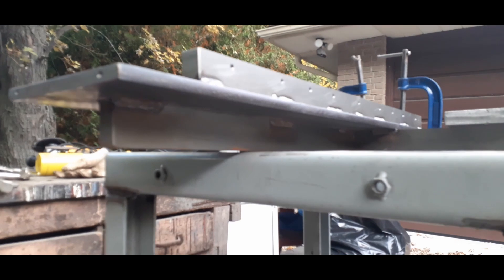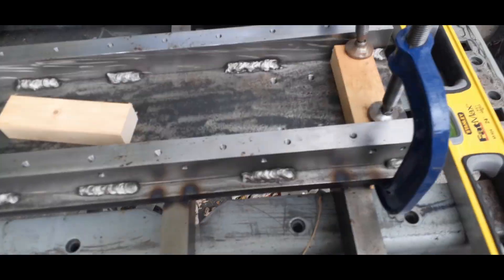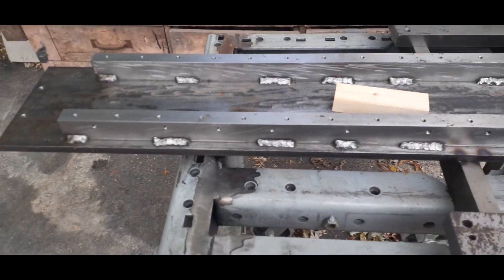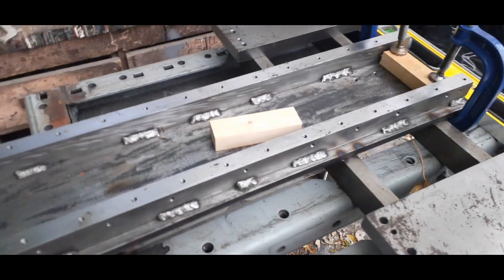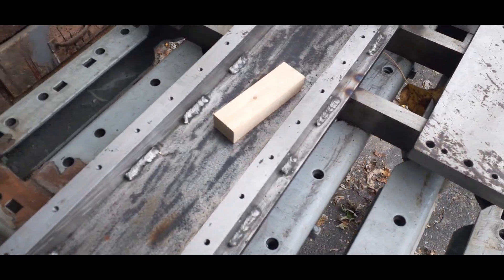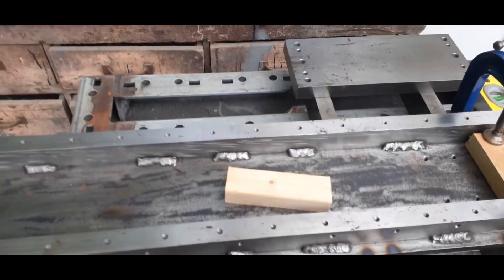Underneath there's ribbing — larger one-inch by one-and-a-half-inch cold rolled flat bar, and then two parallel flat bars going across underneath. The linear rail bases are just stitch welded to try to keep it flat and prevent distortion. There's a guide rail — a reference edge — that gets bolted to the side of this member, lapped with abrasive, and shimmed to keep it straight. A 24-inch straight edge will be used to set the reference edge perfectly straight, then the guideway will be clamped to that reference edge and the second rail set with a dial indicator parallel to this reference rail, and everything will be torqued down.